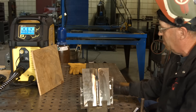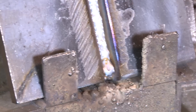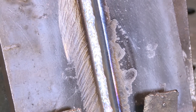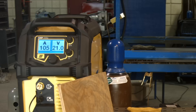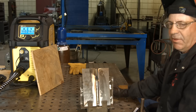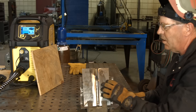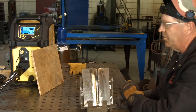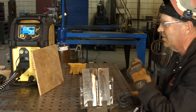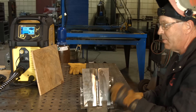What a great arc that was — that was impressive. Before turning this over, I would expect to have more reinforcement than when I had this set a while ago. A minute ago when I pulled the trigger it was reading 21 volts, about 107 amps — it sounded wet, hot, fluid. I knew I was breaking the sidewall down. I went ahead and changed this to 230 inches per minute, which is equivalent to the three sixteenths thickness on S-MIG. I expect to see more reinforcement.